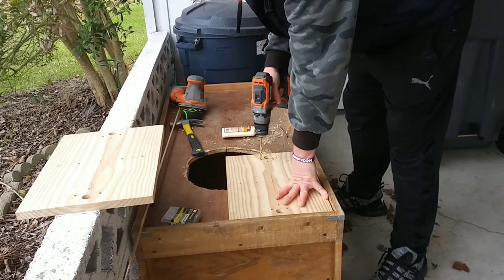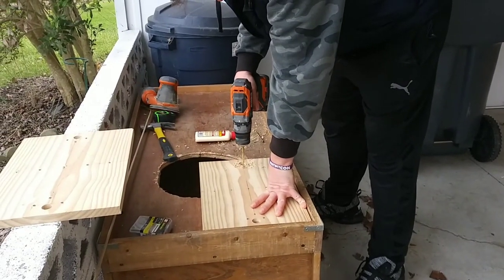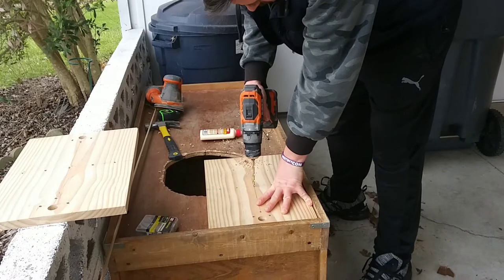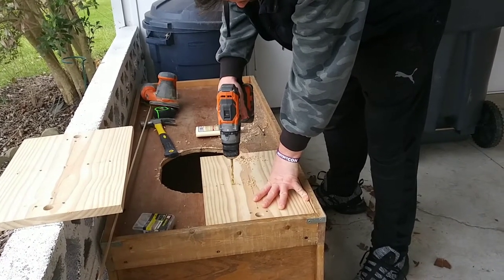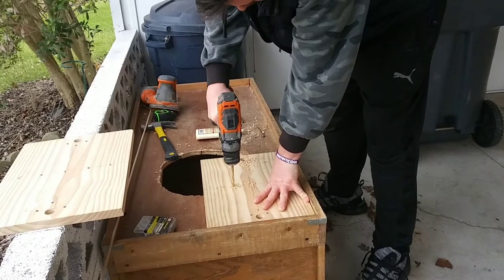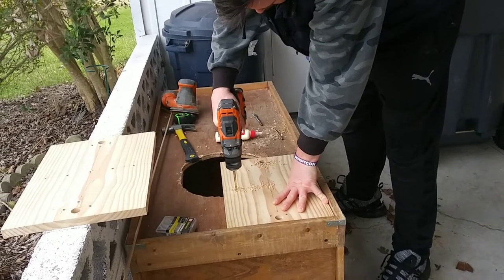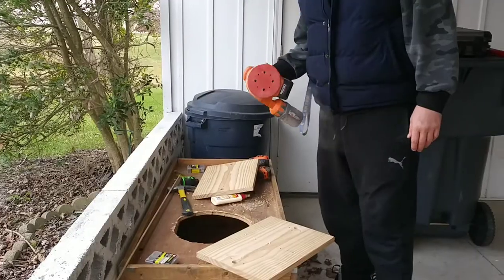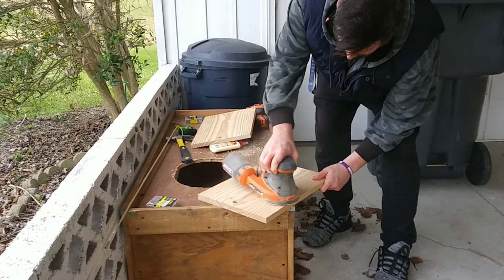All holes can be drilled completely through the board, even the peg holes. Also, when you're drilling the peg holes, remember to keep your drill as vertical as possible. That way you won't end up with crooked pegs. After drilling, you can sand the top of the game board to make sure the playing surface has a smooth area for the penny to glide on.